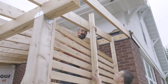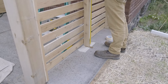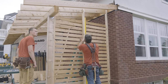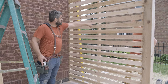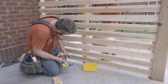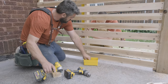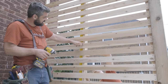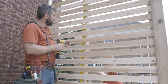We've found our center, we've got our board plumb, and you may notice we have a shim under the bottom of it just to keep it an eighth of an inch or so up off the slab — that'll keep it from wicking moisture up the board and making it rot before its time. At that point we can scribe just like we did the other two, make our cuts, and we'll be ready to attach. Now Grady is going to hold the new board plumb while I come down and attach the bottom. As we work our way up, I noticed a little bow with the level against the board, so we're using the level to straighten it out and going perfectly straight. I'll put one screw in the middle to keep that from moving around as we're putting in the last screws.